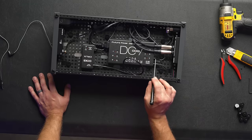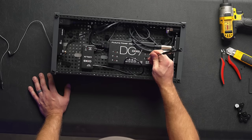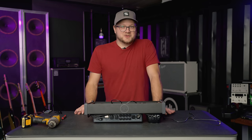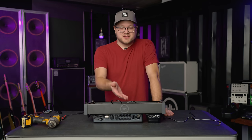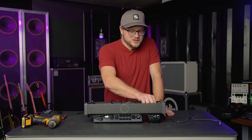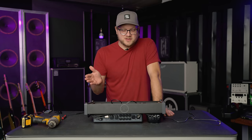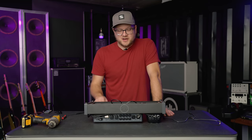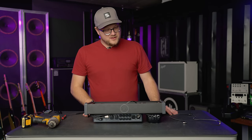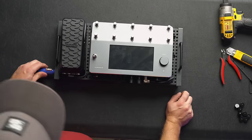So we've got the LEDs plugged into number 7 here. Let's set that left dip switch up and make sure that right one's down. All the other ones we've got set to 9, not that it really matters right now because we're not using any of them. But in most cases, most pedals on the market are 9 volts, one of the exceptions being something like the Quad Cortex. Our LEDs will work at 9 to 12 volts. 12 will get you a little bit more brightness. Okay, so in theory, everything should turn on when we plug this in, so let's try it out. Are you ready?